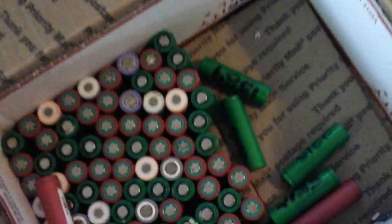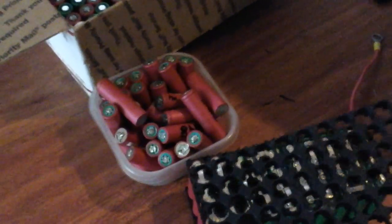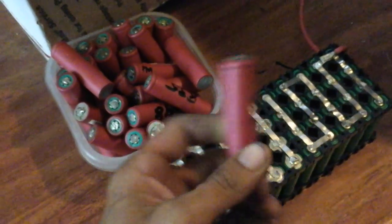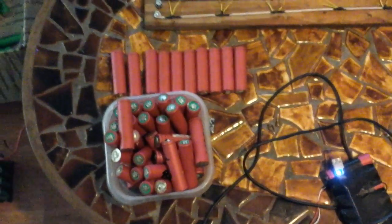If you don't do that, all it takes is just one of these to go bad. I had built one big battery pack that was 80 cells — it was the other side of this pack right here. But there was one bad cell because I was anxious to build it. Just one. And it had ruined all of these and partially those.